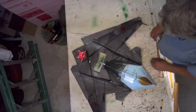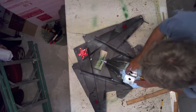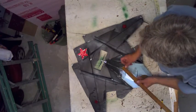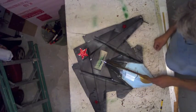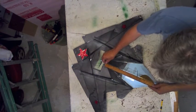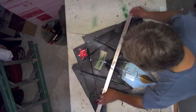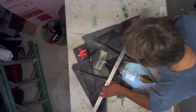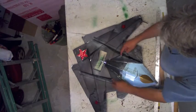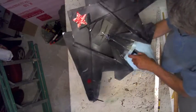I've cut a hatch in here, and I brought it a bit more forward because the battery is up under this portion — basically the end of the battery is about flush with the top end of that opening. I put that about seven inches forward from the motor cover end. The pattern stops right there, but you can make it longer if you want to cover the motor. Your center of gravity is basically right where the apex of the bumps is. There's no battery in it right now so it would be tail heavy.